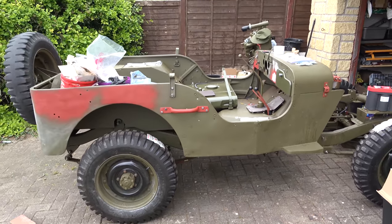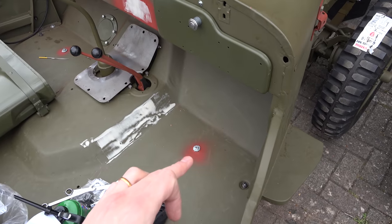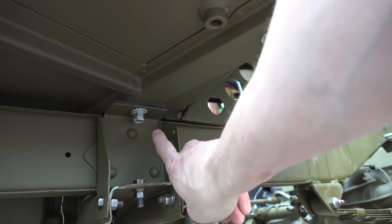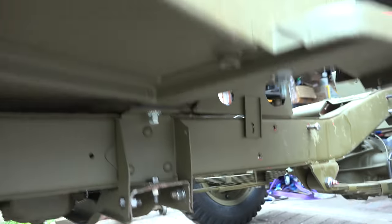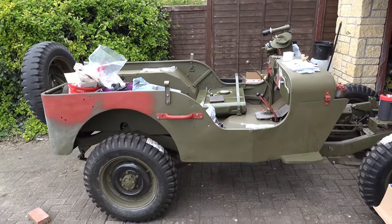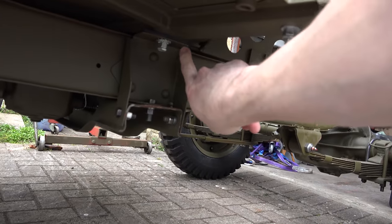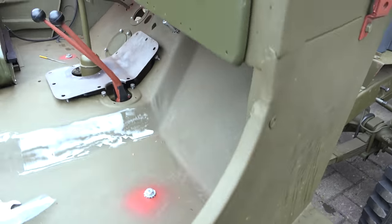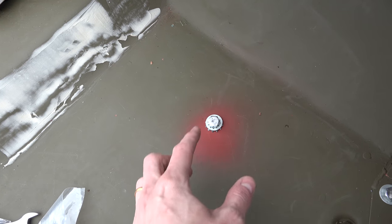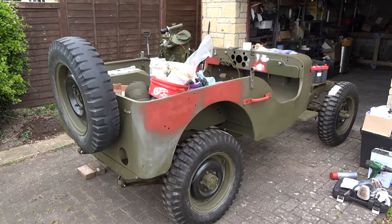I was worried I'd have to take the tub off to drill two holes underneath here to hold the tub down finally, because this floor has all been replaced. The problem is getting a drill in there - it's not easy, it'll be at an angle when you drill. With the corona situation, I couldn't get somebody to help me lift it. So all I did was get a drill with a small drill bit, drilled in at an angle as much as I could, and it worked. It came through the floor - I could just see it poking out - then I worked across from where it was showing and drilled with a proper drill bit down for the bolt in the correct place. So the tub doesn't have to come off. It is on there finally and it's worked out really nicely.